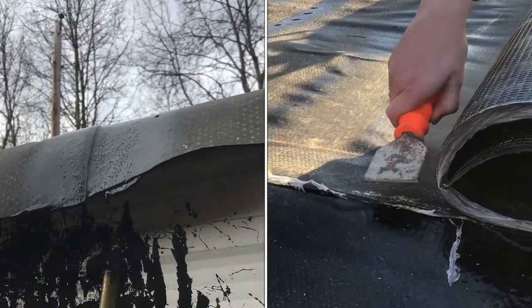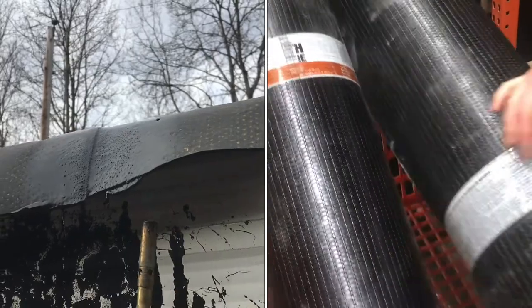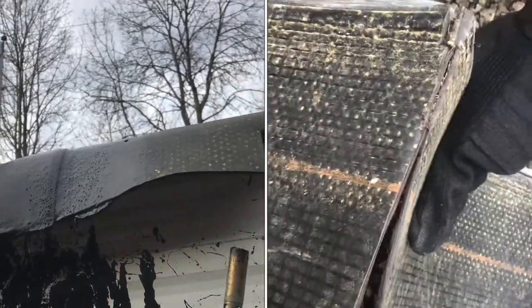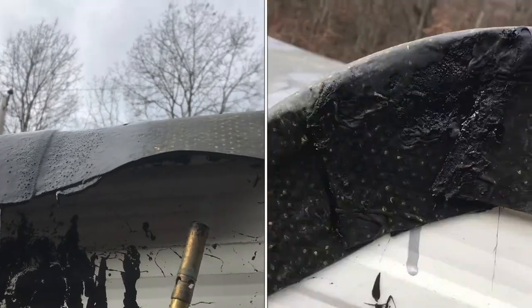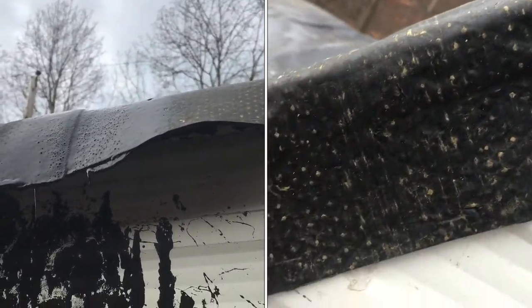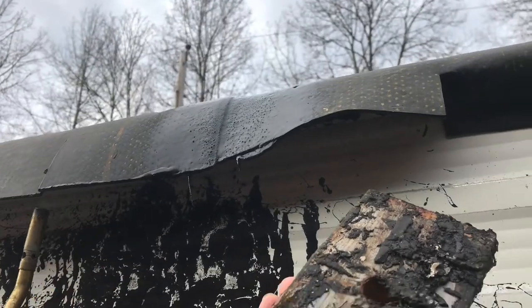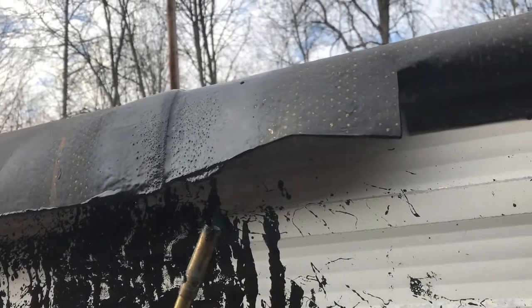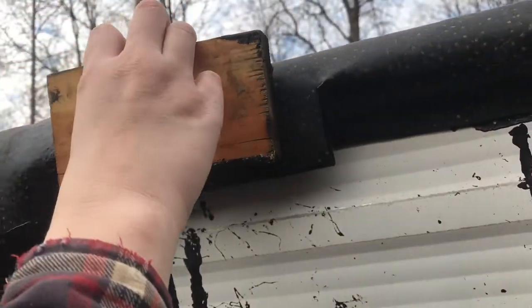On these edges we're just wrapping it, softening it with the torch until you start to see a little bit of a gloss and you'll start to see this flap move down as it softens. Then we'll be pressing it down with this block — now this should be gooey so we're pressing it down with the block.